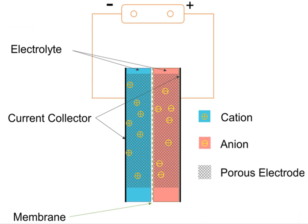Topic: Measurement. Conventional capacitors are normally measured with a small AC voltage of 0.5 volts and a frequency of 100 Hz or 1 kHz depending on the capacitor type. The AC capacitance measurement offers fast results, important for industrial production lines.